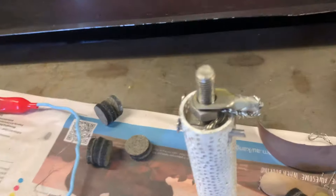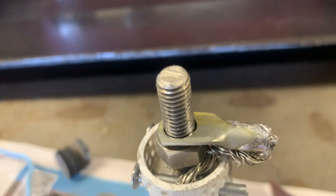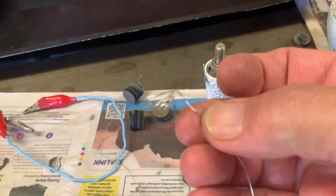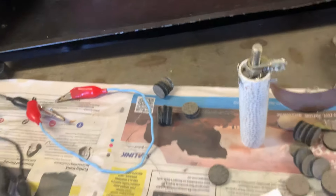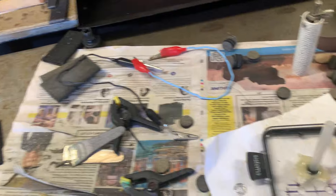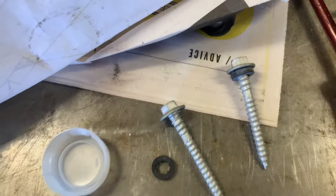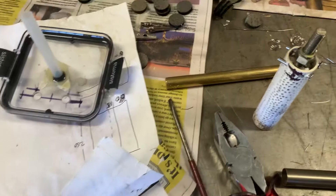Two cells are assembled now. I've decided to go with the connection onto the bolt as the contact point for the cell. All the little wire contacts go in here, soldered in. Not sure if I should grease it or not. They'll clamp to the underside of the lid. I'll bolt through those two holes, and to seal the two holes, a piece of rubber from a roofing screw fits over there nicely. Then the other nut holds it all down through the lid.